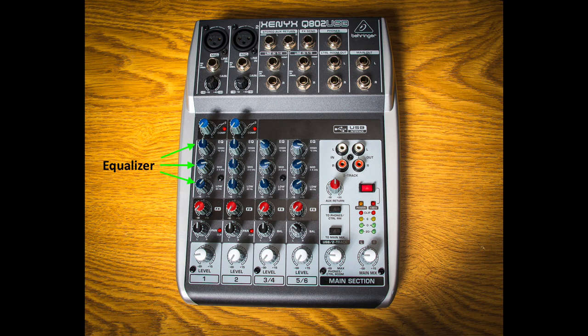All bands provide a boost or a cut of up to 15dB. When the controls are in the central position, the equalizer is inactive, so you can get a really good roll-off or roll-on of highs, mids, and lows. Some large mixers have more equalizer bands, and some small mixers only have two bands. If you're looking for a mixer, make sure that it has at least three bands, particularly with the mids centered at around 2.5kHz. For shortwave listening, which is a pretty low-fidelity type of audio, it's important to often boost the mids to dig out better audio from the shortwave signal.